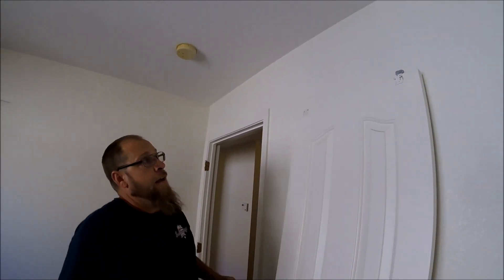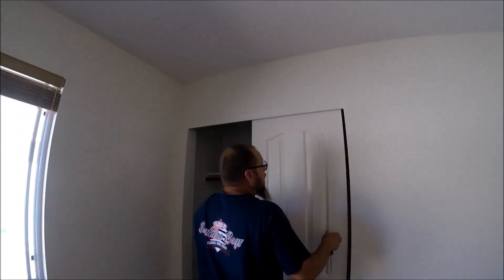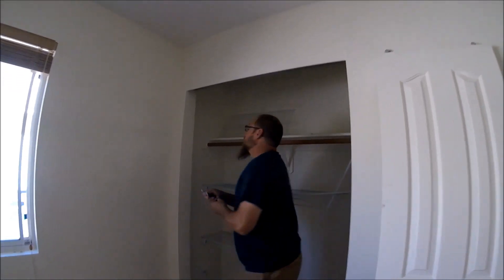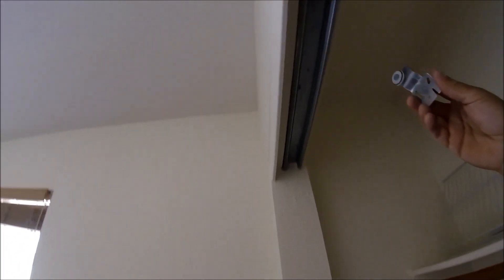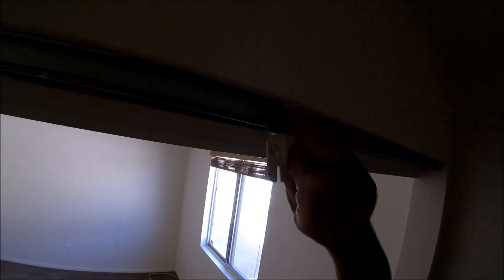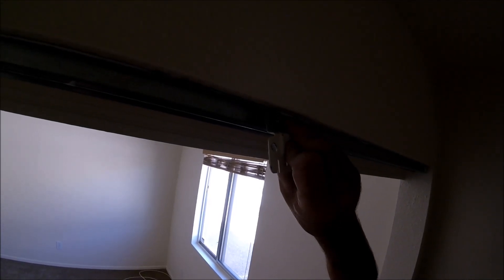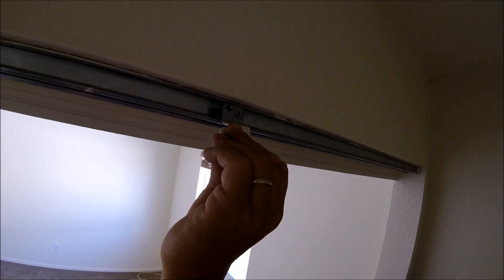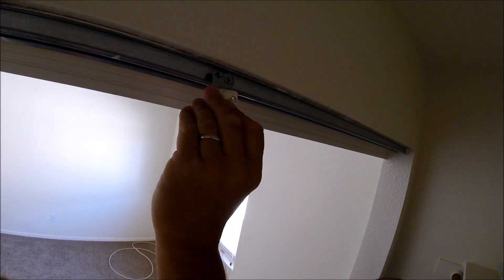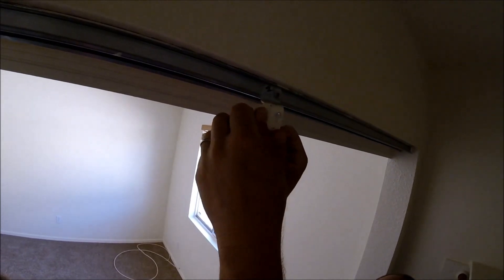To do any adjustment you'll need to take your doors off, so let me show you something quick. This wheel — can you see the track right there? You've got that track that these wheels actually go in. If you've got it just like that, these wheels won't even go in there. They have to go in at an angle because this is curved up right here on the edge of the track. If you just try to go straight in with that wheel, it's going to hit the top and the bottom.